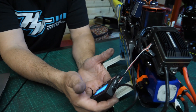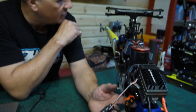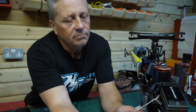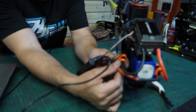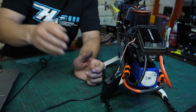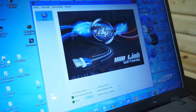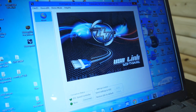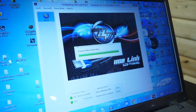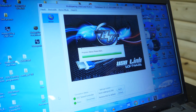Now we've got that there, let's plug in the battery and power up. We've got the blades off for safety — I've never known one of these to spool up when you're doing this, but it's wise to do that just in case. Now we plug in, and what will happen now is we need to ask the program to connect to it. So we go to 'Connect' and click, and just wait a few seconds and you should get a little bar come up. There it is — it stopped beeping and there's the bar downloading what is in the actual ESC at the moment.